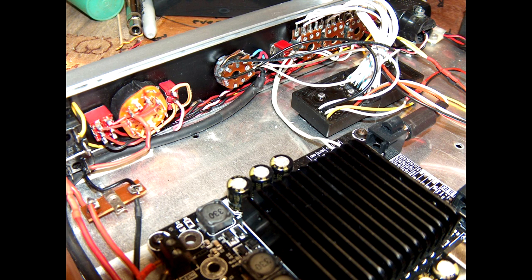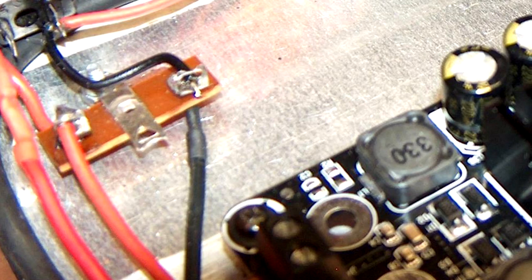This is the rotary switch. You can see how the power switch — there are four switches wired up in line for the powering. So you have the left-to-right master DPDT toggle with another baby DPDT toggle in red, with the rotary switch and then the momentary contact. You can see how cute that little standoff is in there doing nothing. It looks like I've extended one — that black wire going underneath it with a piece of shrink on it. It's great when you go back and can at least laugh at your own work.